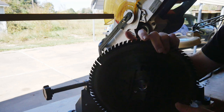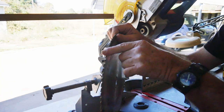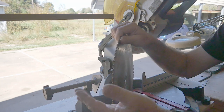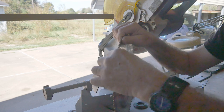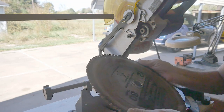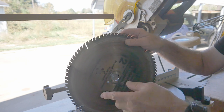This is sort of like a cabinet or very fine blade. It has 80 teeth, and it's what we call a straight cut — there's no angles to these blades. They're straight, with a piece of carbide at each tip, but they're straight — no funky angles, not like a sawtooth blade. It gives a really nice cut, it's a little slower to go through lumber, but it cuts really well and really straight, so there's very minimal sanding. The downside is just the slow cut. These are generally used for fine work, but I really like them — I use them on both of my big 12-inch saws.